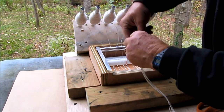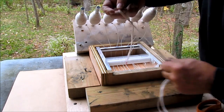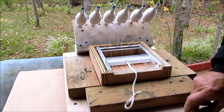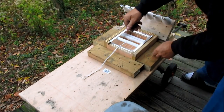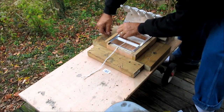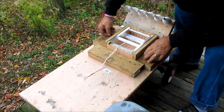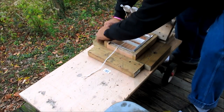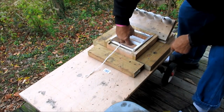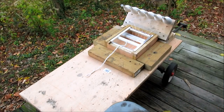I just tie a loop here, which will be my attachment point to my drying rack when I start pulling the string through the slurry. I've put my whole loaded rack onto the wagon. I'll be pulling the wagon from the string end, and I'll just wrap my wire around the whole machine here to keep any of that from pulling up as I'm pulling the match. Now as I'm pulling the match, if there's any tension on it, it can't pull the machine up out of the box. So now I'm ready to load slurry into the tub and the machine.